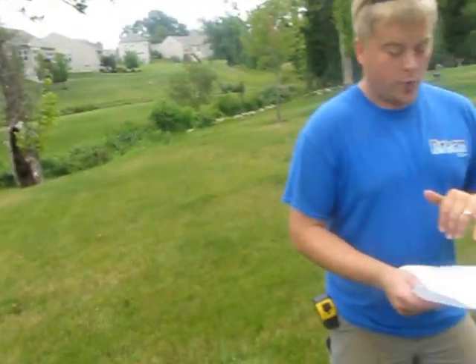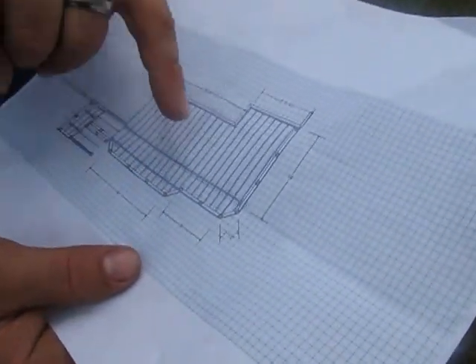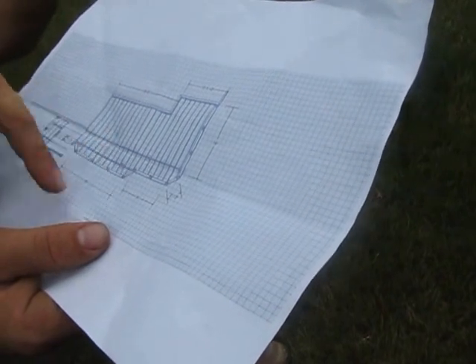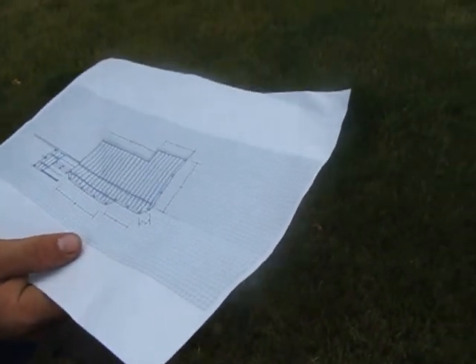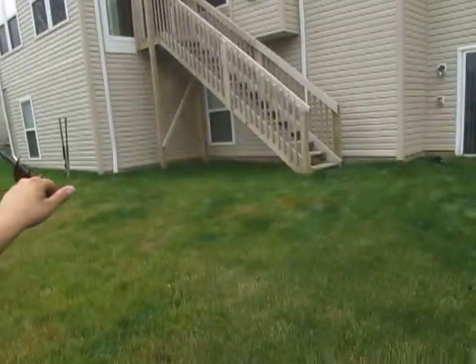So in doing that, we're going to upsize our deck floor joists. Instead of using 2x8s, we're going to use 2x10s. That'll give us a longer span from the deck ledger of the house over to the beam. And then from the beam, we can cantilever up to 3 feet per the city code out here. Our beam from this section of the house we're going to come out 14 feet. From this section over here, we're going to come out to approximately 12 feet.